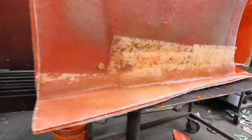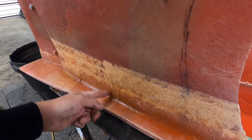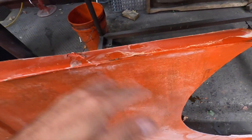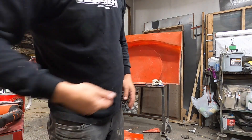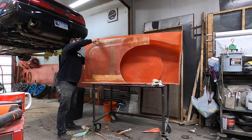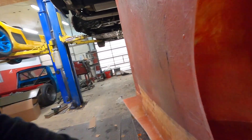Here we are the next day - flange is done. I'm gonna pop this apart and check out the surfaces. It looks like it bonded really well at the flange so it'll hold vacuum - another great success. Here's the flange we added - you can see it's got a nice seal. We'll drill a couple of holes through here for bolts, and then we're ready to make some carbon. We'll cover that process in the next video.